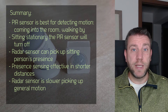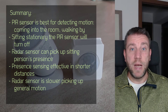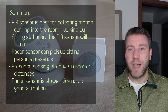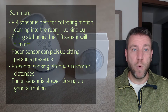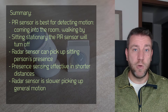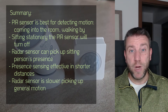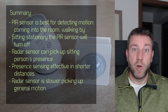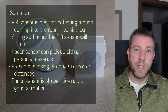The thing the PIR sensor won't do is continue detecting you once you sit down and stop moving much. After some time — in my case around 45 to 50 seconds — it will detect no motion and turn off. So if you want to use it to keep the lights on while you sit and watch TV or read, that light is probably going to turn off. That's where the radar presence sensor comes in, because it is more of a presence sensor than a motion sensor.